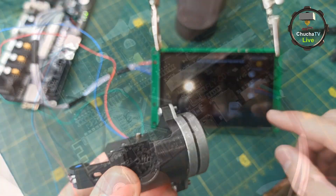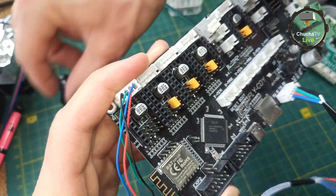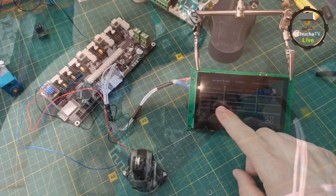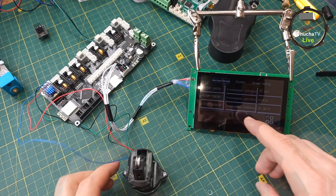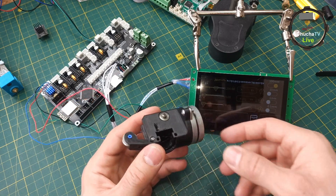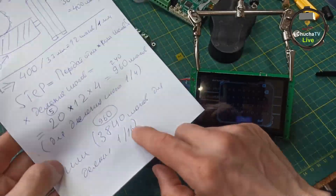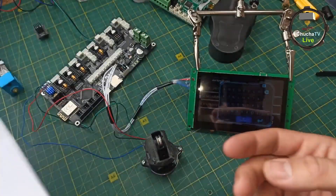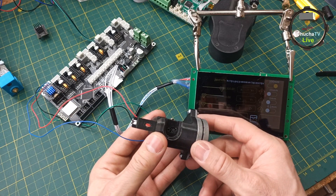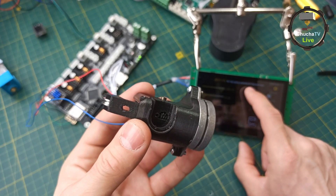Now as an experiment, let's remove the TMC 2225 and install a jumper, setting it to 1/16 microstepping, and install the TMC 2209. As a reminder, we currently have 240 steps set. Let's run the experiment first — it runs very slowly, so filament feed will also be very small. According to our calculations, we should set 960 steps to get the correct step count at 1/16. We set 960 and run the movement. Watch how fast the gear spins again — no jamming, no problems at all.